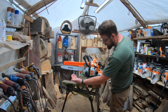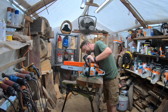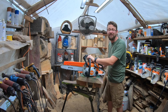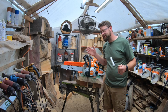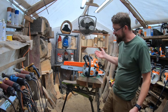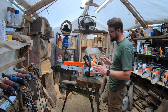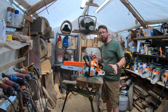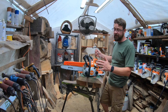So, brand new Stihl MS172C. I did carve with it in another video, in case you guys missed it. What's this run? 16-inch bar, 3/8 pitch, 43 gauge chain. They used to put 50s on all this stuff. They must have watched my videos because I've said they should go down to 43. Cuts faster. It's not grabbing so much bite with that bigger tooth, but I like 43 gauge chain on these smaller saws. I think it rips. It's all a homeowner needs. And honestly, if you're carving and detailing, that's all we really need too for smaller stuff.